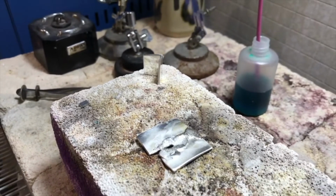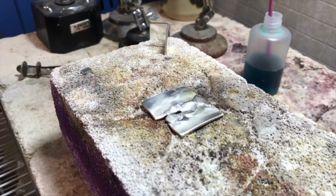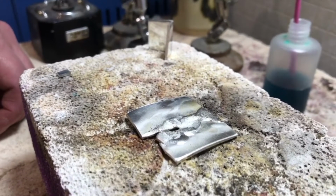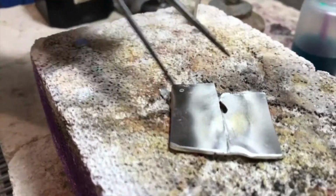The solder that's used with pewter is a little bit more brittle than silver solder, so I would be using that as a final fabrication step, and I wouldn't recommend planning any kind of forming on it, since it is brittle and it's quite easy to crack the solder seam.